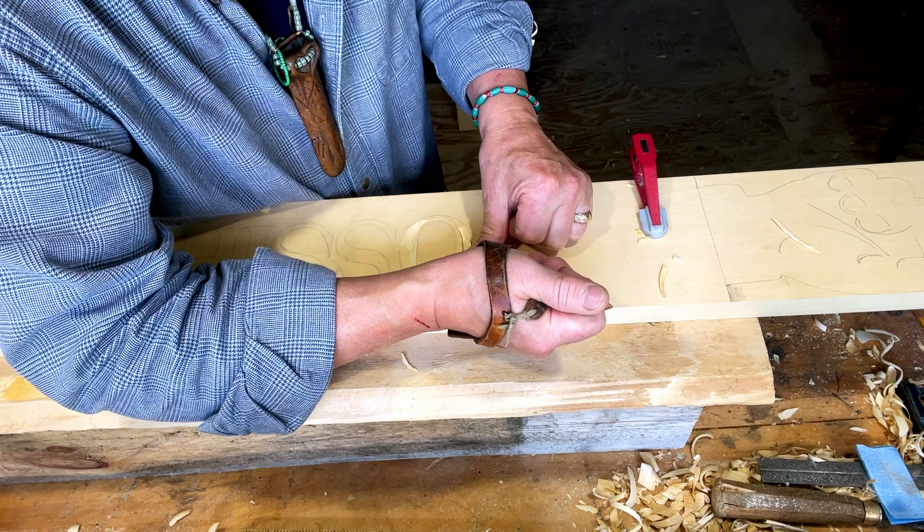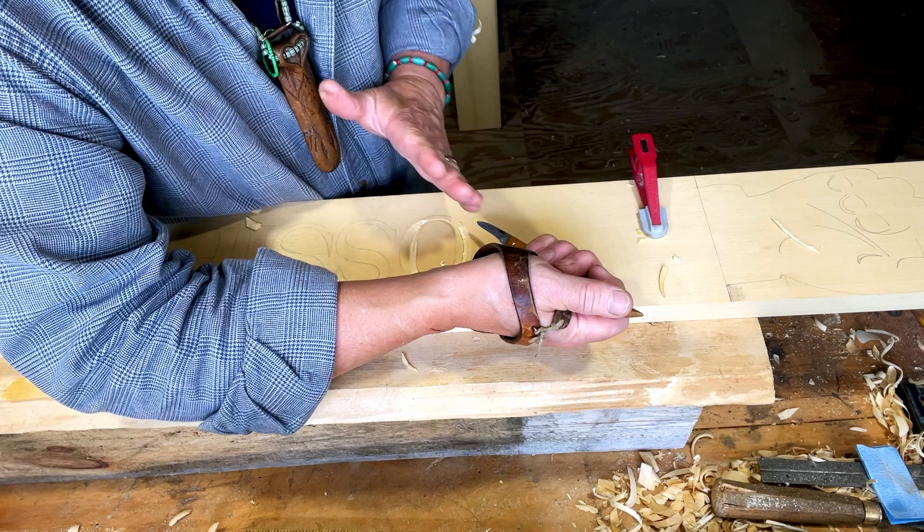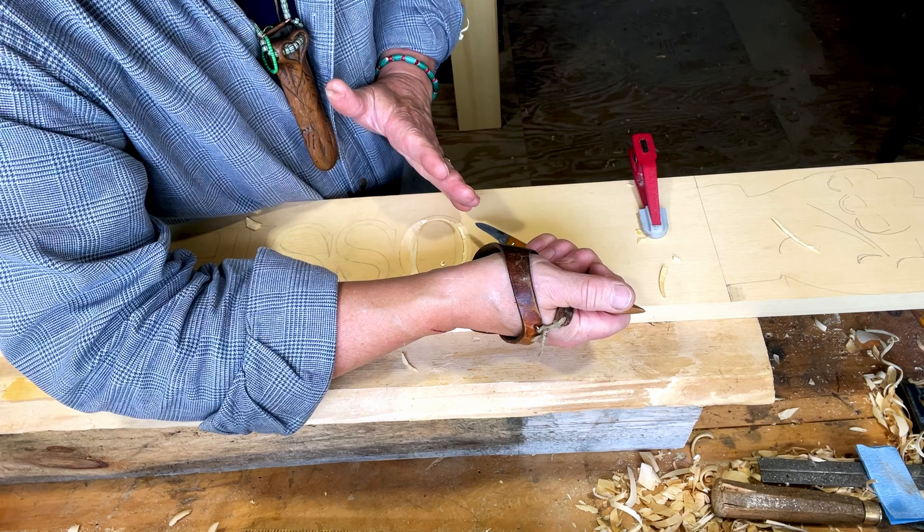Now I'm using my left hand as an additional force. When you're cutting across grain like this, it's nice to have your blade slanted — like they'd say askew. It creates more of a slicing action rather than forcing a straight cut, you know, straight chisel right through the grain. The grain would resist more.